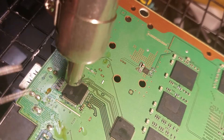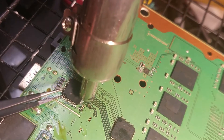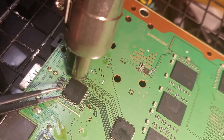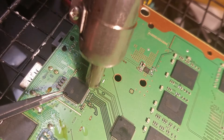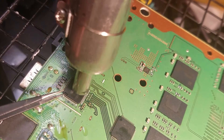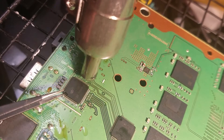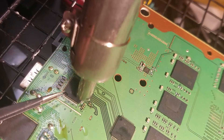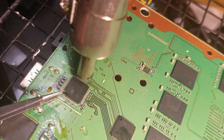If you want, you can grab by one of the pins there in the corner. The chip is actually very brittle. I think this one's been cooked a few dozen times, so I don't know why it failed. Don't yank it up early though, or you'll rip pads off, and that's not going to be a good experience.